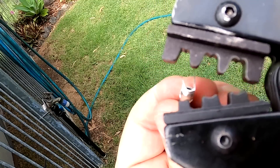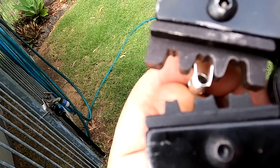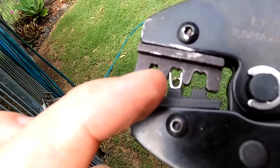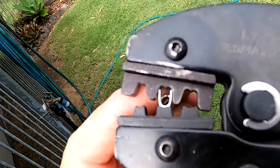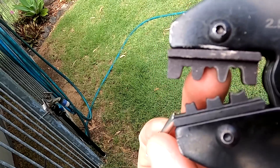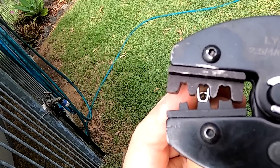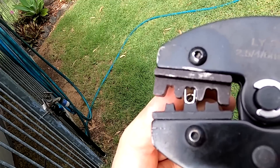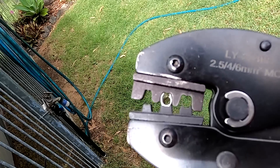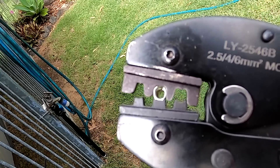Here in better light — don't put the pin this way around, put it the other way. When you close the claw it pushes these two metal wings up. See how it has this heart shape with a little notch in the middle — that notch is there for reversing the wings so they fold back downwards. When I push this down, see how they bend and come back down onto the wire.